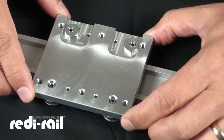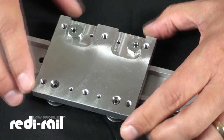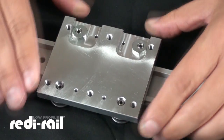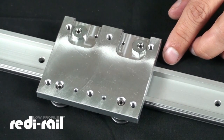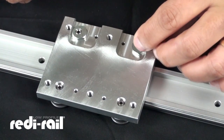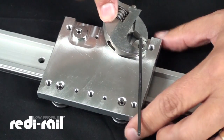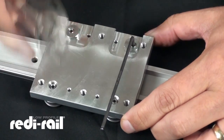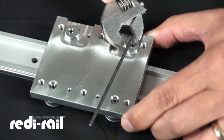I've set this up deliberately with a little bit of play. That can happen over time as bearings wear or as there's vibration in the system, and you want to take that play out. You'll need to remove whatever plate or gripper you have mounted in order to make this adjustment. All it takes is a simple Allen wrench and either an open-end wrench or a crescent wrench. Loosen that set screw and then pivot the eccentric cam to where there's a little less play.